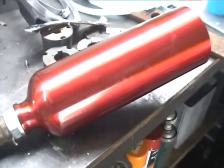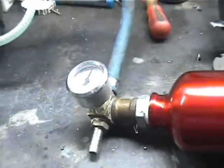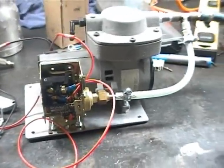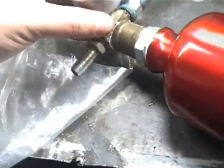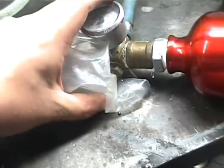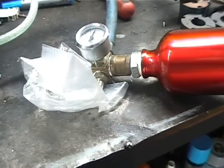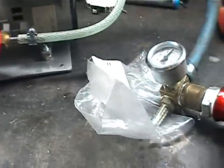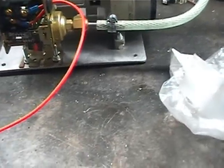That's a fairly simple system — there isn't a lot else to tell. So what I'll do is a quick demo. I'm going to take a piece of plastic and press my thumb over the vacuum port. We should see the vacuum gauge give us an indication and the pump should turn off. I've just got a 12 volt gel battery here just to do the test. I'm going to turn on the pump and then cover up the vacuum port, and we should see the pump kick off and then kick back on again as the vacuum falls off. Here we go.